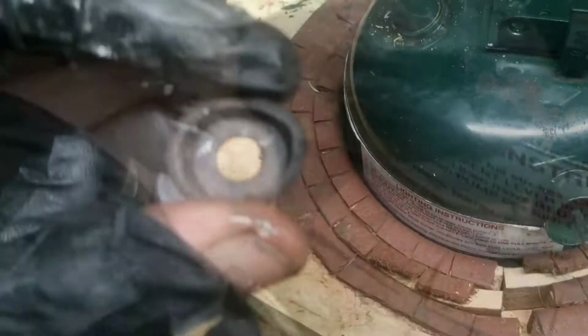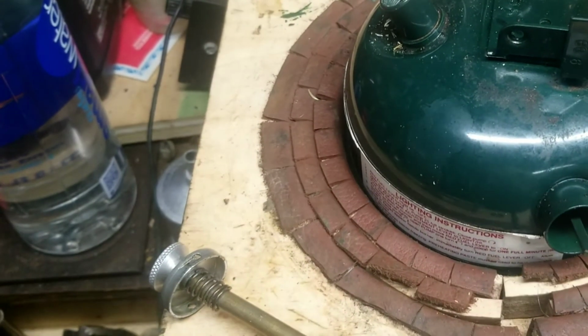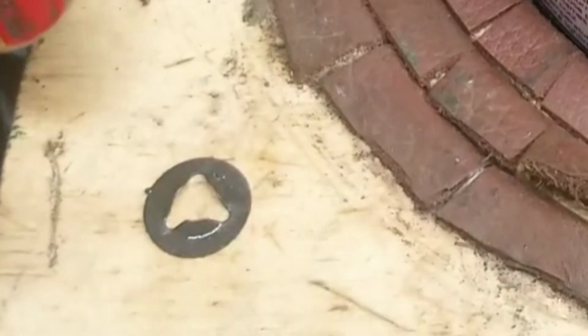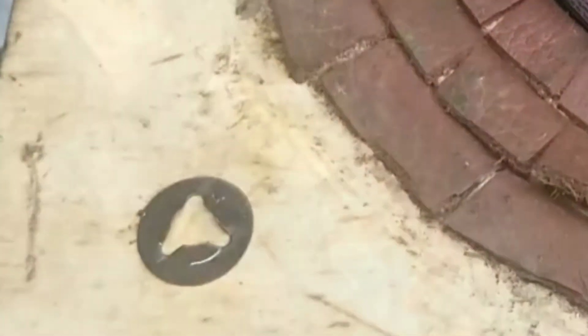That'll come off. Another pump leather. It's a used one I salvaged off of something else, but it will work fine. What I like to do, before I pried that off there, I lay that little retainer clip flat. I don't want to mash them all the way down, but I'm going to just mash it a little bit to try to bend them little springs back down a little bit, just to give it a little better bite.